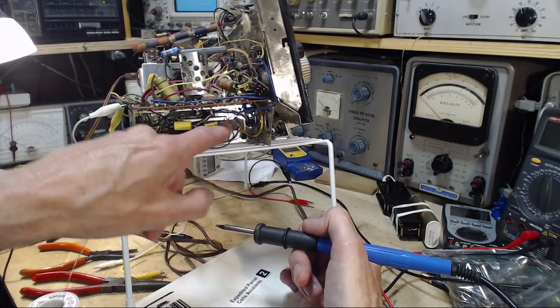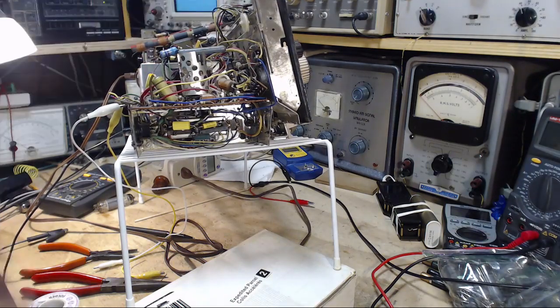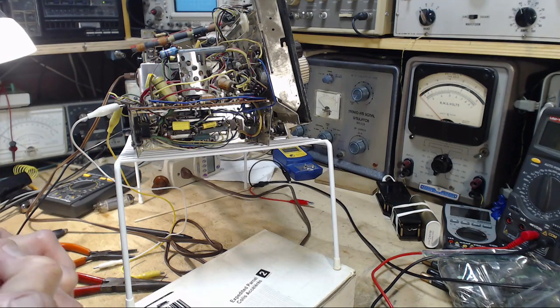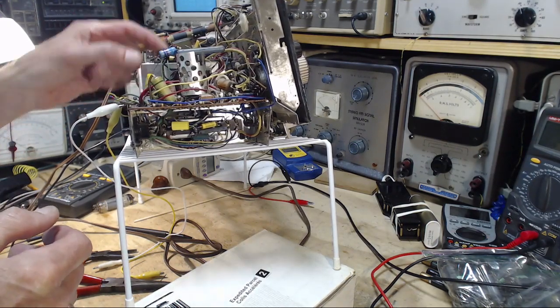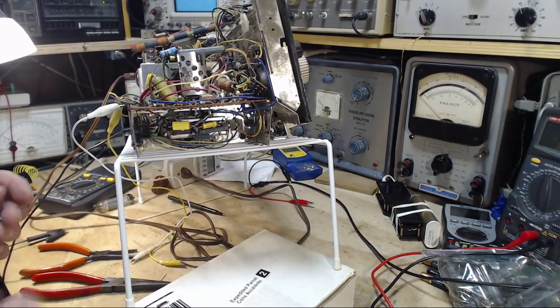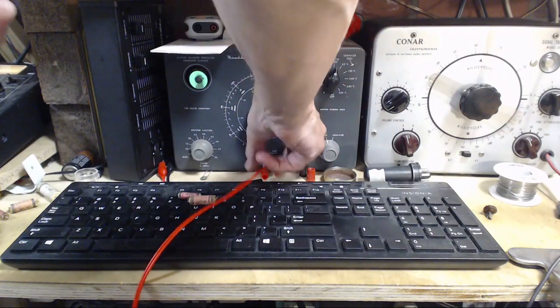I think I got it. Okay, so that takes care of these capacitors. Now, I guess these are involved with the tweeters. Tweeter signal. Good. So that's really it. I think it might be time to test this guy, considering all the stuff I've done here. Okay, I'll get him set up for a test. Actually, maybe the first thing to test are these capacitors I just took out. Here, let's do it with the shorter leads.